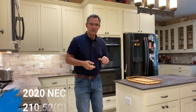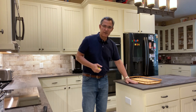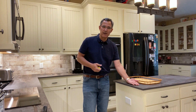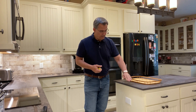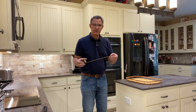Some people find this confusing but it's pretty simple. Outlets can go in many places — they can go on the surface if they're rated as what I call the pop-up type outlets: you push them down, they pop up. You can't have a regular outlet just facing face-up on an island or any countertop, you can't do that. But most outlets on an island will be on the side or on the face.